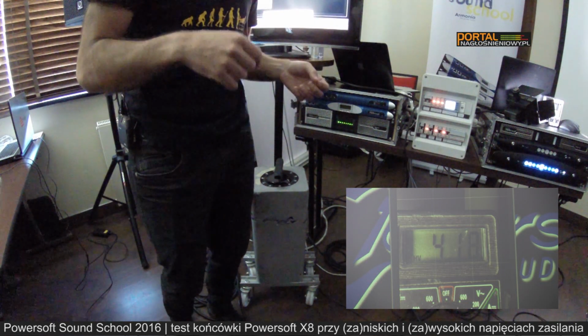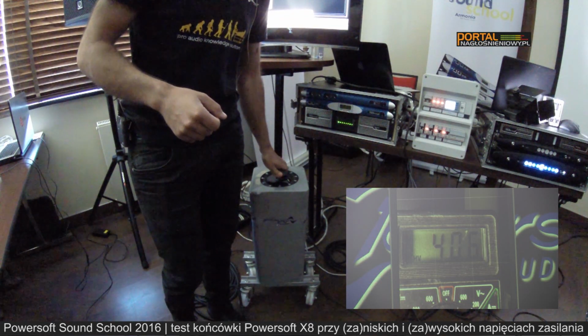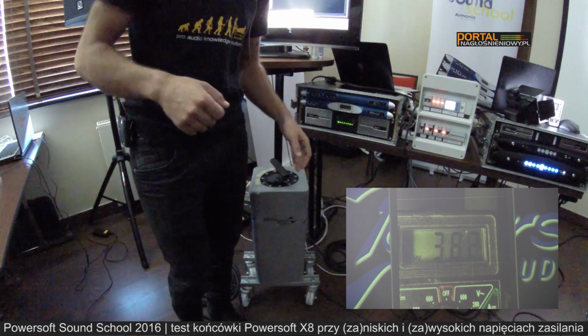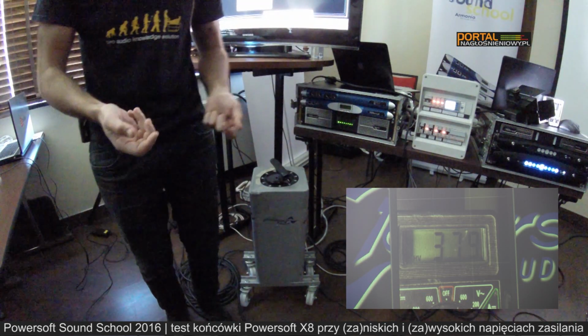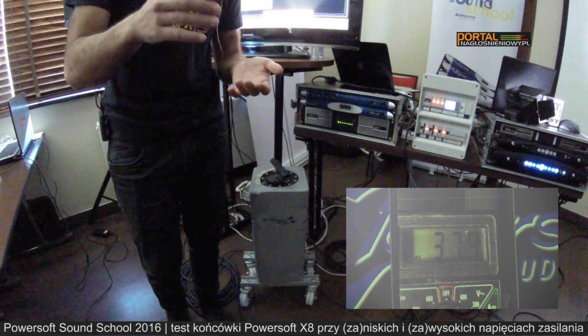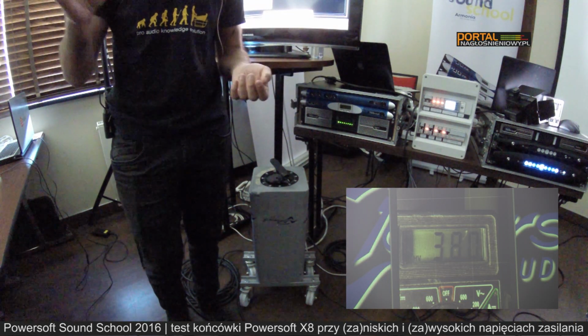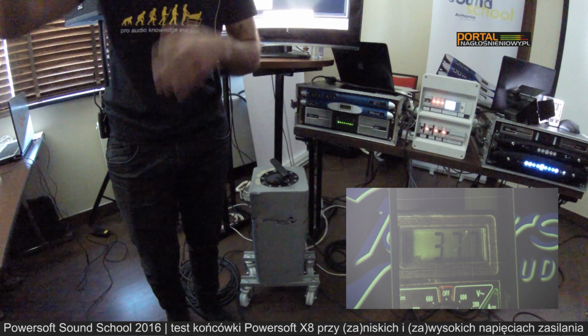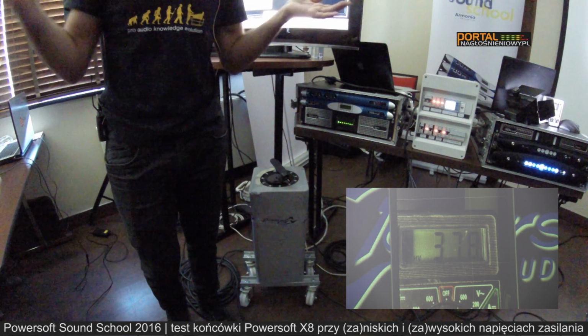We had a client that was complaining, my amplifier is turning off. It's turning off by itself. And we went there to analyze what was the cause, and we found that they had 600 volts spikes on the mains because it was near a hardware with big machinery. So it's just that the amplifier was shutting down and turning on again.